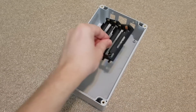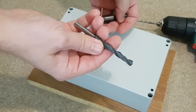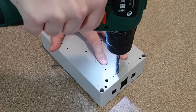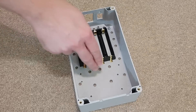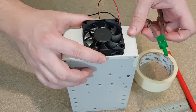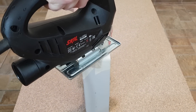The battery holders will be mounted in the back of the switches — I just mark their position and make holes for the 3mm screws. A chamfering bit smooths out the edges of the holes, or you can use a bigger drill bit. On the back side I also made holes for the circuit boards and ventilation holes so air enters through the bottom panel. Most ventilation holes are placed around the battery pack. In the back panel I'll make a large round hole for the fan, covering the panel with paper tape first to avoid scratching it, then using my electric jigsaw.